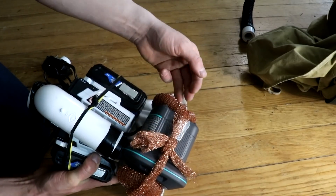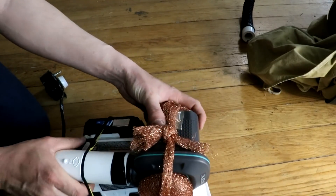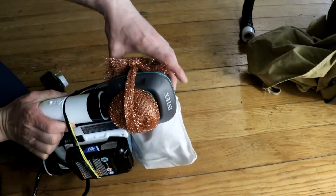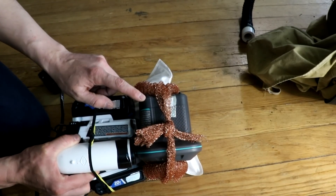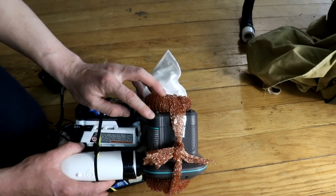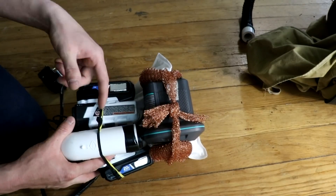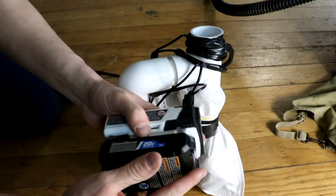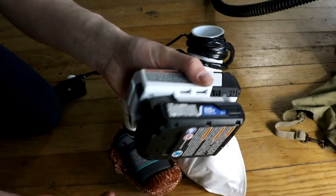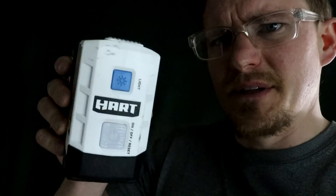This also helps cool the blower because now air is able to come across it. The blower is a 110-volt AC inflator pump — it's actually the same one I purchased on the first visit to Walmart. The 110 AC does complicate things because now I need to use an inverter. I've got a couple of little inverters here and battery packs to step up the voltage and alternate it. This is really cool — the battery pack just plugs in, very compact, very nice. I never do sponsored videos, but if you want to find one of these, that's the company that makes them. A bigger single inverter would probably actually be better.